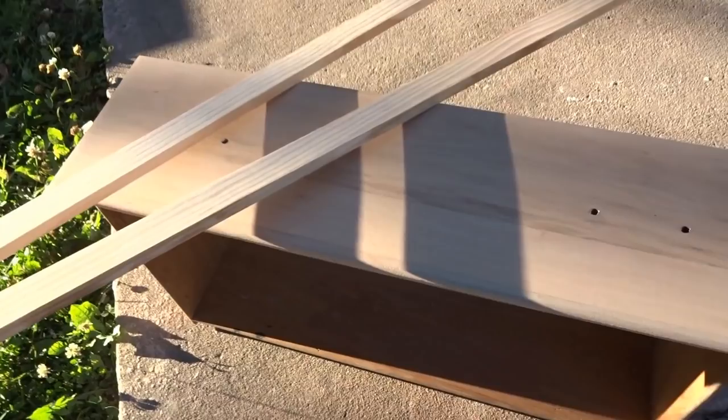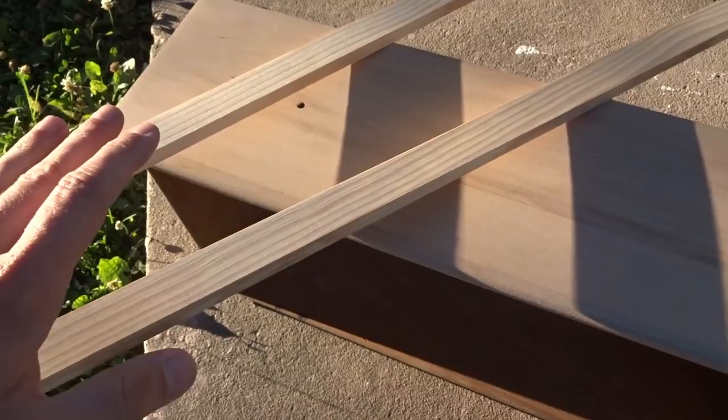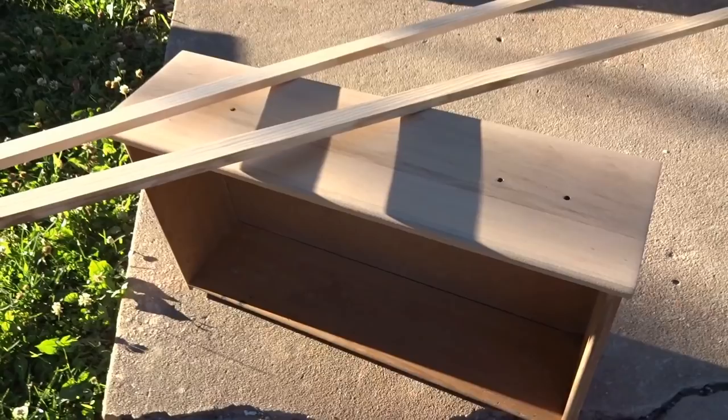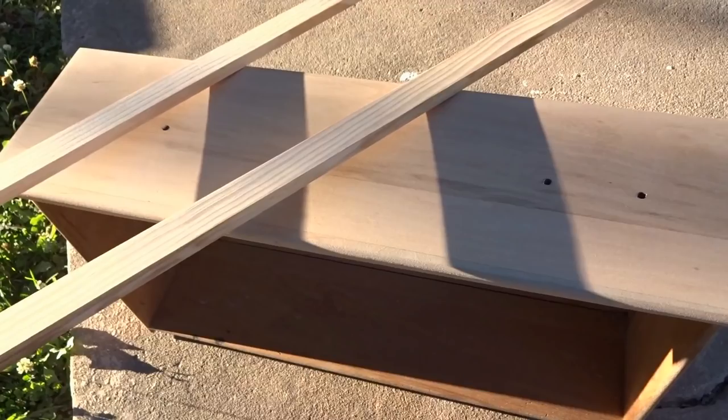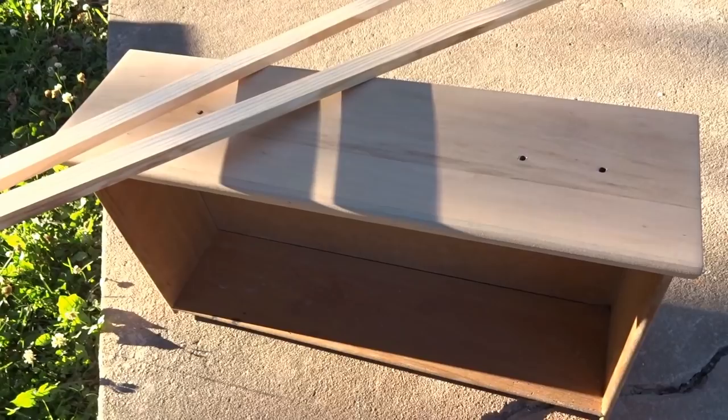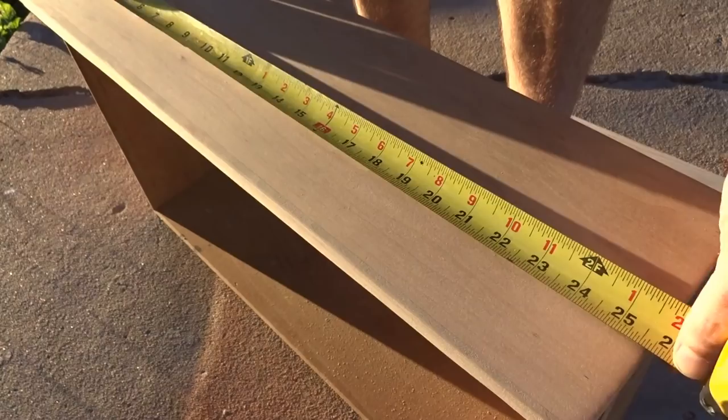Now that all the painting is done, all I've got to do is build the little wood panel drawer. I have some wood stock here — it's half inch thick, inch and a quarter wide, made of pine, so it's a nice light color. I'm just going to build a border all the way around it, then divide that in half horizontally and then in half vertically to give it that real legit woody look. I'll test fit it all before I stain or anything to make sure it works. The pine pieces are just going to get polyed so they stay nice and light, and the drawer face itself is going to get stain to darken it up and then get polyed as well, so there'll be a real nice contrast.